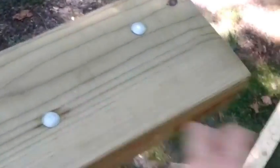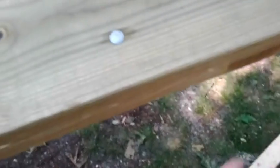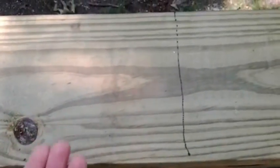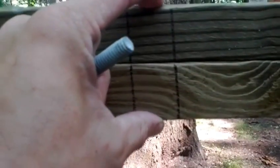On this side I've marked where the four-by-four goes, and on this end I've marked where the tree goes. I'm setting three-eighths carriage bolts through them to sandwich and reinforce the glue. I don't want the carriage bolts where the tree will be, because the tree is on the inside face and the carriage bolts stick through that inside face — they'd be in the way. The second marking shows where the bolt rests on the bottom of the beam.